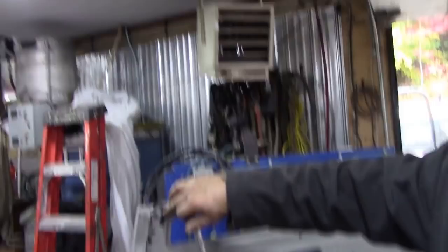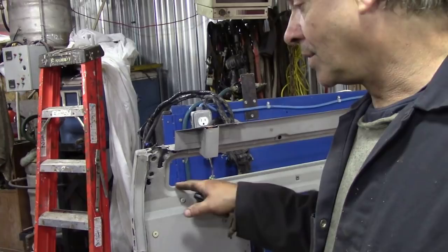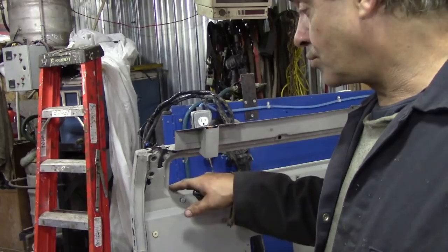So with the plasma, I'll only need a straight edge because there's no fancy rounds in it or anything like that. And I was thinking about making some steel templates, but quite frankly, paper ones are just as good. Yeah, but it's just a shame that nobody's come up with the idea of making an insert to go here, like the full corner, because this is where they rot out. Like, just cut it off here, cut, and put another one in. Easy. And then just weld round it.